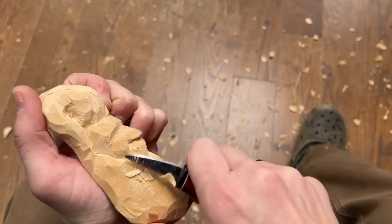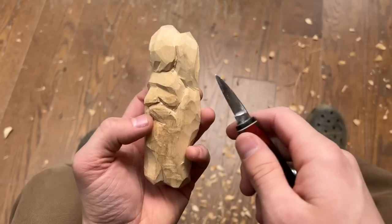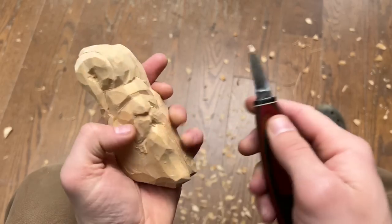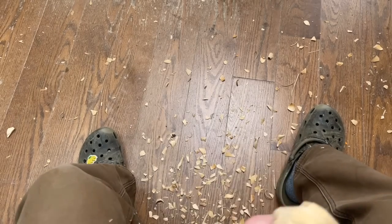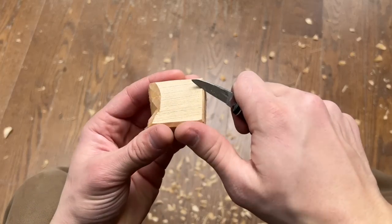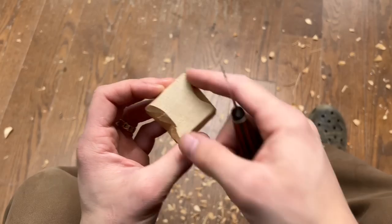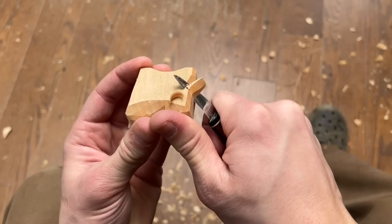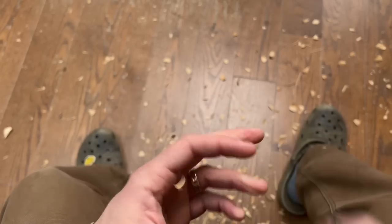I'm going to pause to polish up my blade for a moment — you can see the reflectivity of the tip needs to just be polished. I'll grab my WorkSharp and just pull this across. That reflection is mostly gone, so that's a good sign. Taking the rest of that chatter out. A little scooping cut — if you don't have any skills in scooping, find yourself a little scrap piece of wood and just practice on the corner, just the scooping motion. You can't always do this on every side of the wood — not every corner will allow you to do that.